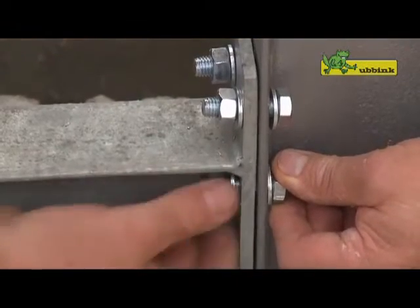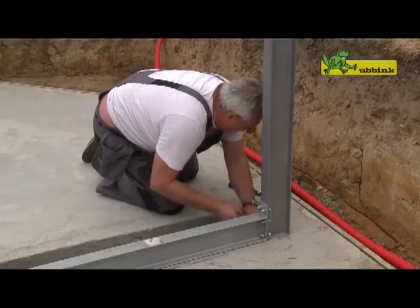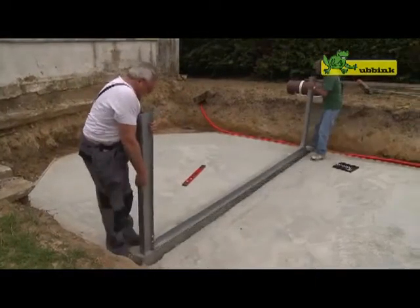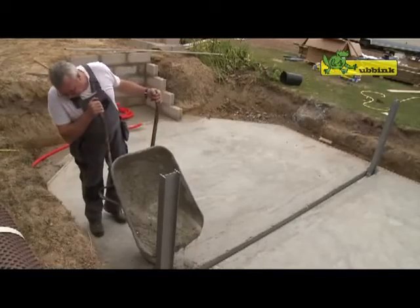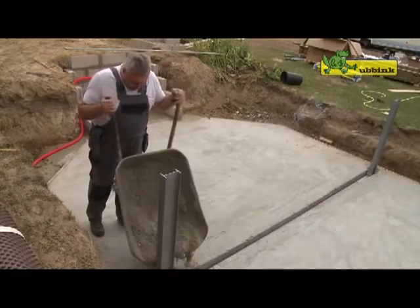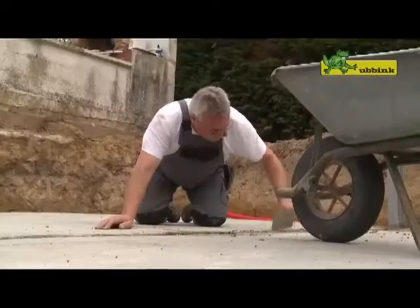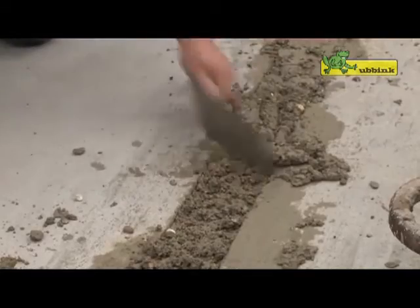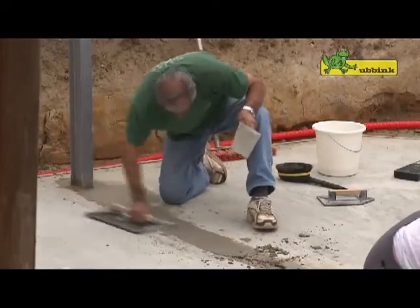Assemble the horizontal brace with the two vertical uprights. Position the brace for the 400 by 610 model and fill the trench with concrete. It is also possible to set the brace directly into the concrete when making your slab. Please check on the model of your pool, as it may be designed to have 1, 2 or 3 metal braces.